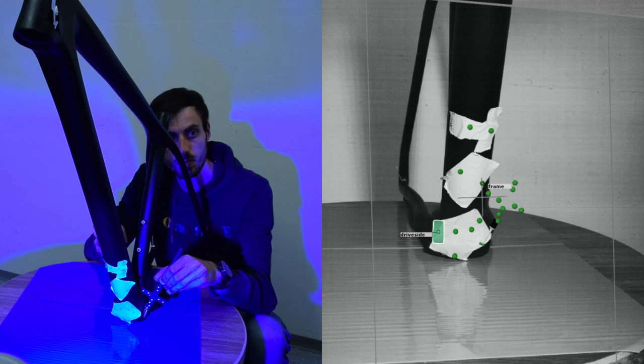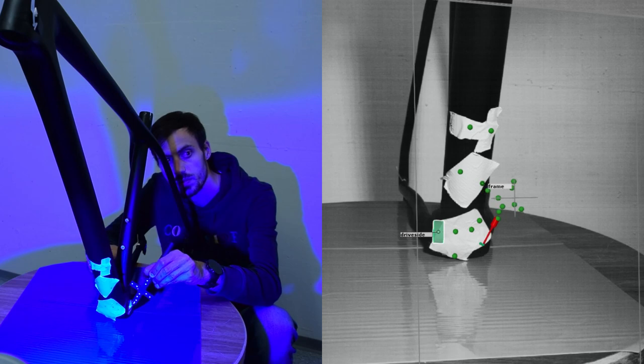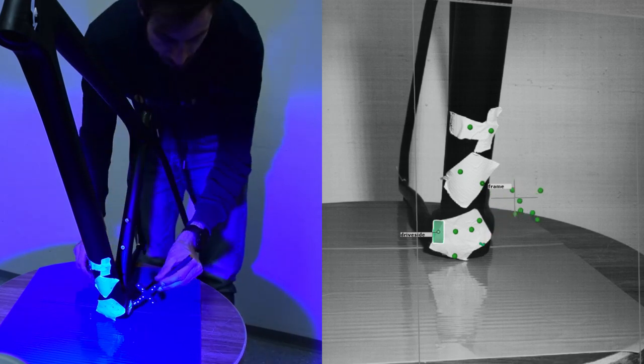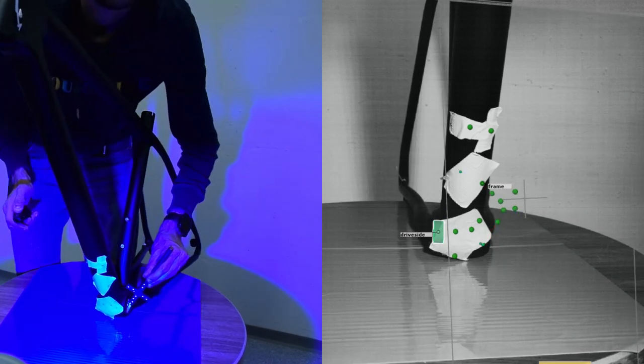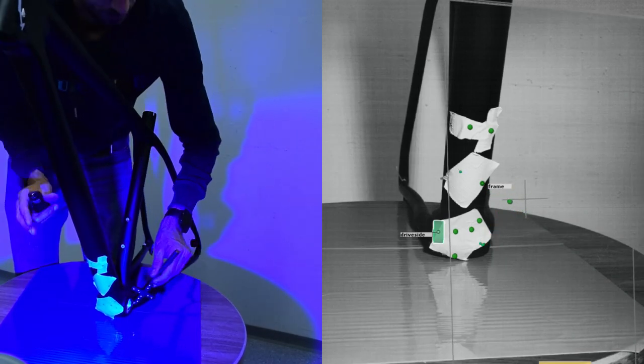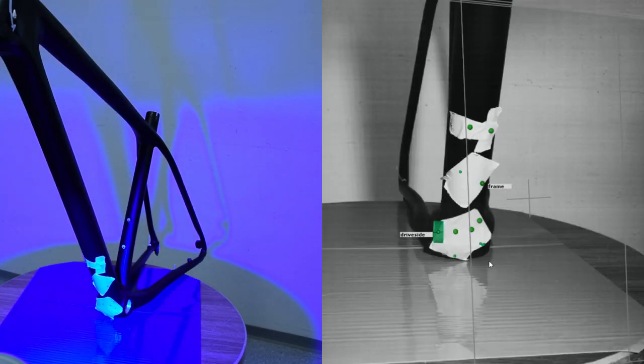At the moment, there is quite some debate on which bottom bracket standard is best, especially now as a lot of manufacturers changed from press fit to threaded design again. Personally, I would have preferred a press fit bottom bracket on this frame, as they are much stiffer than threaded bottom brackets. But maybe I'm just biased by Hambini's opinion.